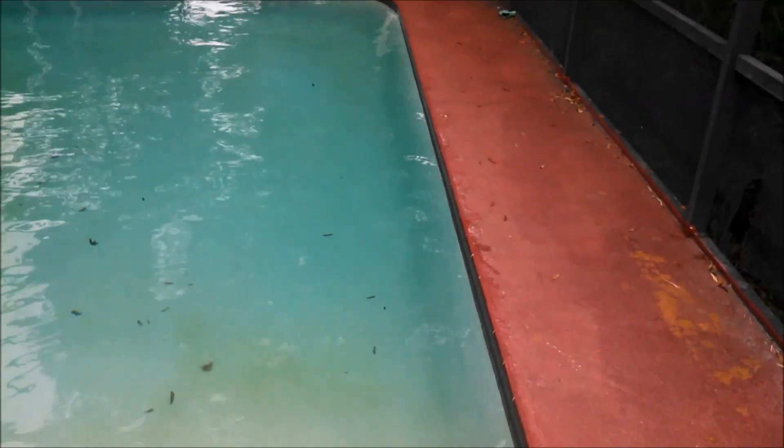When I get to this wall, I don't want to stand right here and push the dirt sideways, because all that's going to do is transfer the dirt from here over to there. What I want to do is start over here and go at about a 45-degree angle — that's going to push the dirt down towards the deep end along this side of the wall.